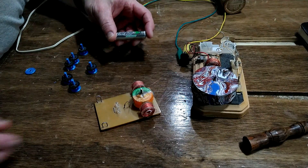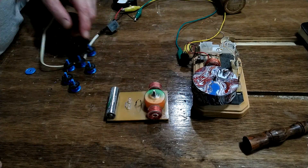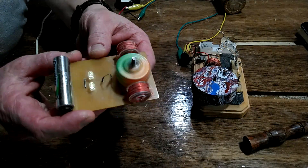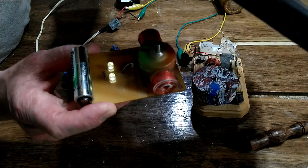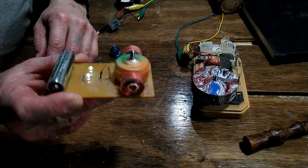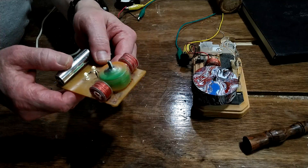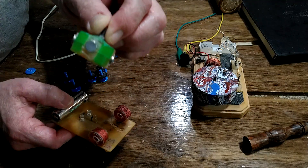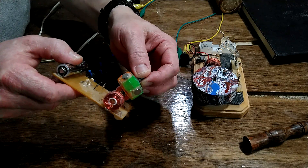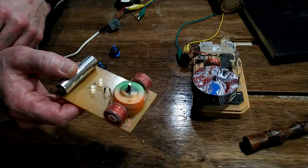This one does run on a battery — just a double-A battery. This one is lighting up LEDs from the collapsing magnetic field, same concept. This one also works very well. Two coils, 30 gauge magnet wire — same thing. The small rotor is just a couple of caps with magnets.